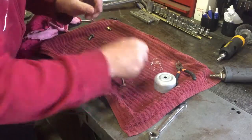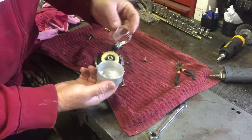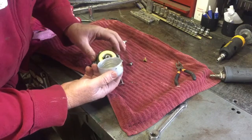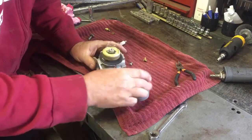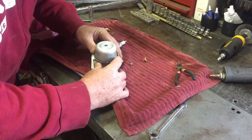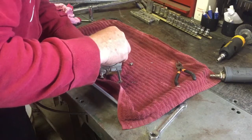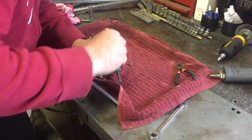Okay, we don't need the old seat, we don't need the old needle, we don't need the old pin. We need this spring. It sits in the bottom of the bowl there, just like that. In fact, I think I'm going to balance that on top of the float. Take the nut. Just going to get that started a little bit. Make sure it's not cross-threaded. Okay, it feels like it's going in.